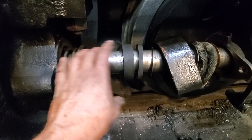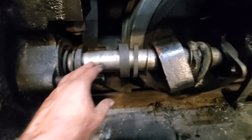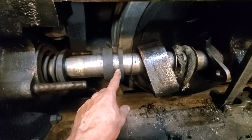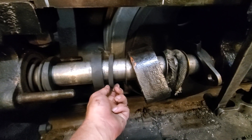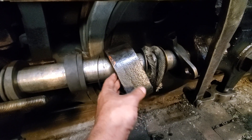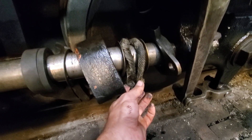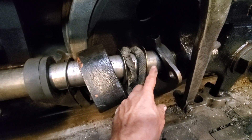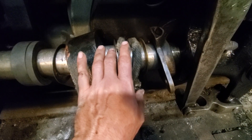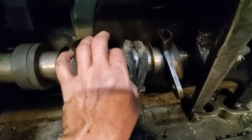Then on the other side you have two more oriented 90 degrees. This is called a Paxton Mitchell packing, and it was designed so that as it wears, those springs will keep pushing it in and it'll continue to hug the rod and not wear a gap in between. Then you've got this steel collar on the outside, then this other ground washer, another little brass washer, the stuffing box cap, then another brass washer, and these two ropes of cotton. Then another brass washer and the brass piece that goes on the outside. All this here is a lubricator — you put oil in, it soaks into the cotton rope, and that meters out oil to the rod itself.